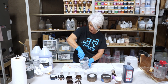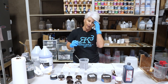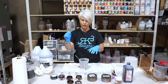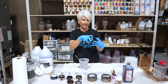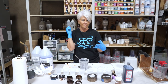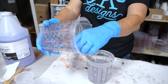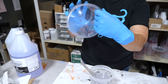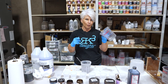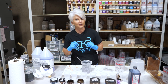One way to know if you're stirring your product correctly and long enough: when you're done pouring your material out, turn your bucket upside down, wait a couple of days, and all of that epoxy will pull right out. If you consistently get buckets with sticky spots, that's telling you that you're not thoroughly mixing your product.